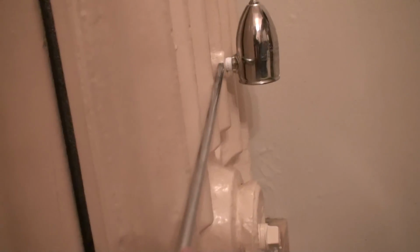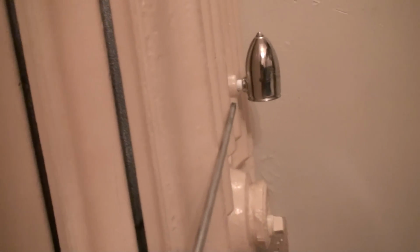Steel convectors are different, cast iron elements are different. But whenever you're dealing with a cast iron radiator, especially one that has a little height to it, you want to go from the bottom and put your air vent at the lowest portion. If you're buying a brand new radiator, that's exactly what you want to do. You want to twist that screw out.